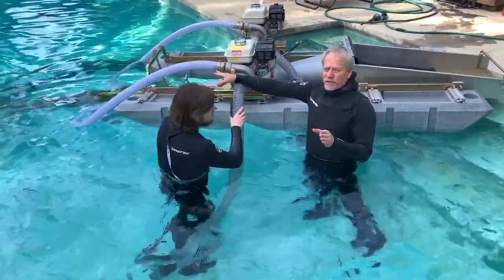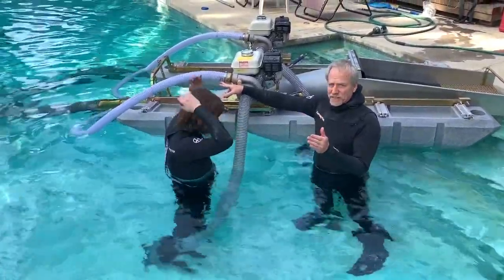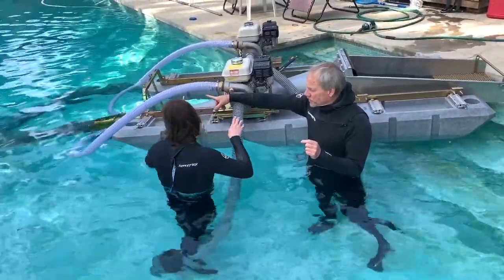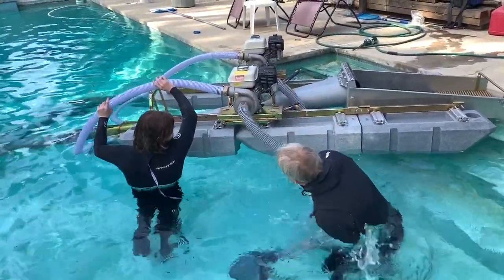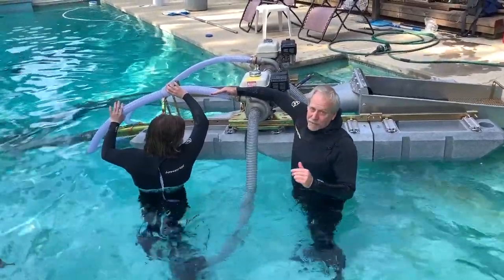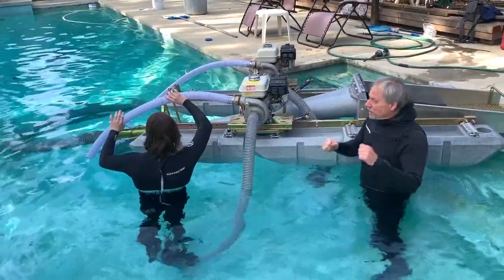A quick note: sometimes if you have any difficulty with the pump priming, even on a dredge, I've had occasions where I'd want to lift the pressure hose up. If I raise this pressure hose higher than the pump and give it a couple of pops, I can actually have the water sitting above the pump. That's a little trick of the trade we learned from the hard school of knocks.